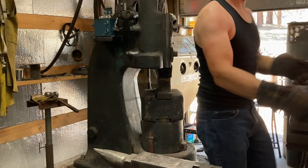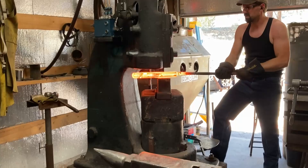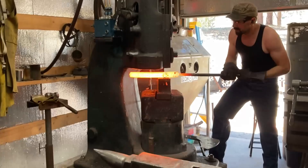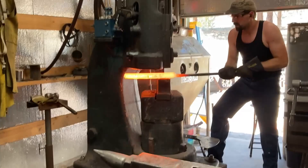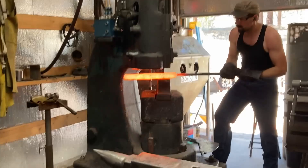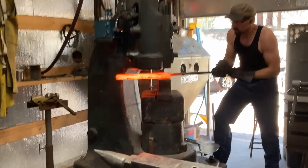The 250-pound Niles-Bement utility hammer converted to air is making its debut as a useful drawing hammer in my shop. I've used it before, but it's better set up now — I added a 500-gallon air tank, which you'll see in the next video about the hammer itself. It actually hit hard and kept forging until I was done with the heat, and it's a ton of fun to use — very gratifying after the amount of work I've put into getting this secondary hammer running since I got it last year. This heat was the first time I felt like it was beginning to pull its own weight.